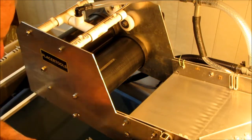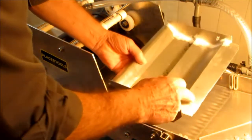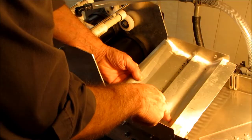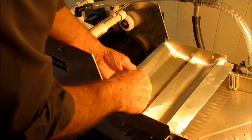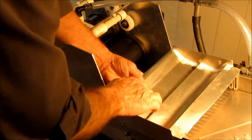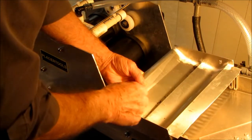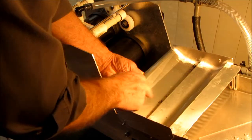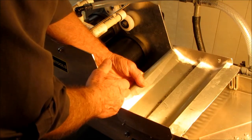The gold trap, as you can see, is easily removable from its position. As the material flows down the tray, it comes to the drop area. The influence from the magnets on the drum starts right about here, and there's about a five-inch influence area. This area is constantly full of water, so your material all flows down there. Your gold will essentially get trapped here, your lighter material will flow off the end down into a catch tub, and your magnetic material will flow across through the material.